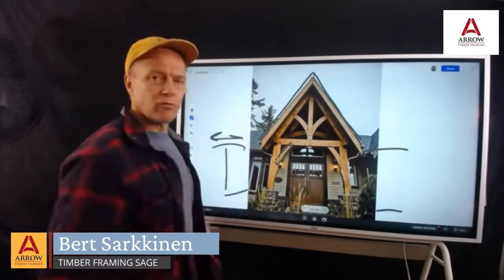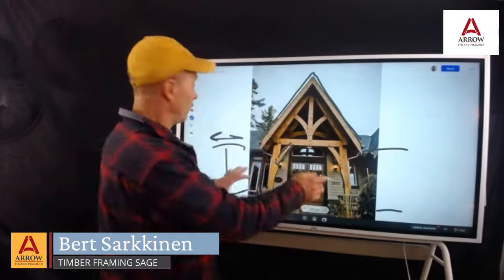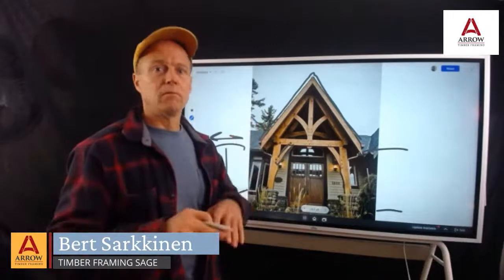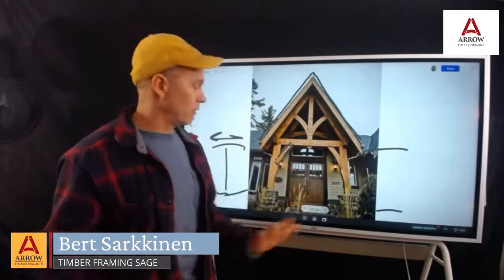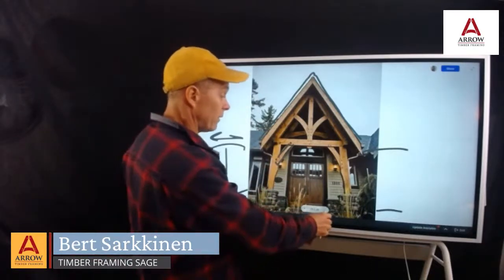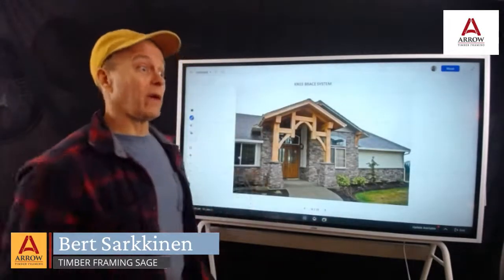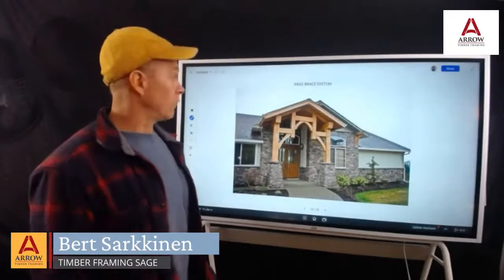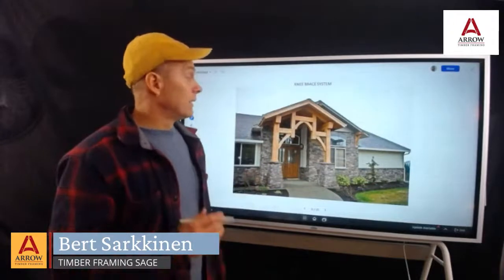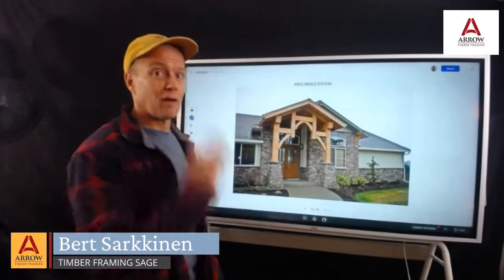Here, just kind of like your situation, John, engineer is not going to bother trying to do any calculations with that. That's just like insurance from their perspective. They're looking at, okay, how many nails do you put in the plywood roof diaphragm? And how do we connect it to the main walls? And if we've got that, bingo, we're golden. We don't have to sweat it. Easy money, easy calculations, nothing new. Done. So that is the roof diaphragm. You'll see that applied in sometimes questionable situations where it's really going out quite a ways. And I'm like, yikes, that's quite a bit of leverage out there just to be pulling back on the house. But it works. And typically the first bullet out of an engineer's pistol.